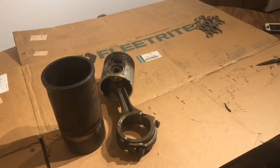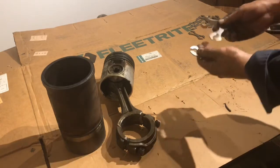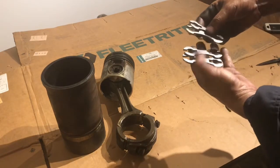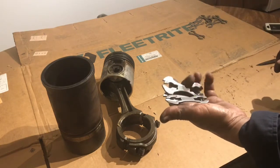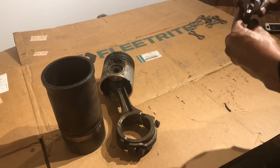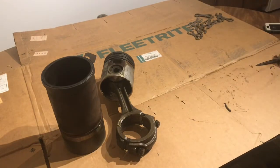Oh, and just so you guys know, International does recommend doubling up on those little lifter wishbones, so here they are. Guys, these are not cheap. $53 a piece, guys. Just so you know, they're expensive as hell, but they do recommend it. I don't want to try and keep one. I'm going to do what's recommended. Hopefully this engine will last Patrick quite a few more years.